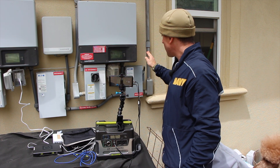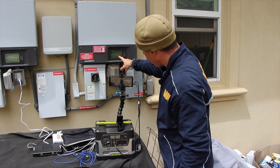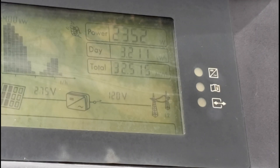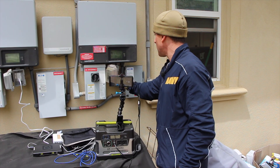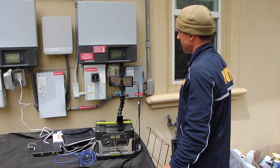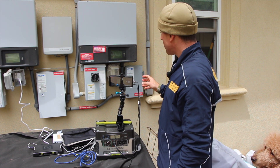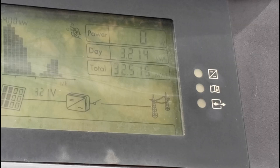So we come across here, the general duty safety switch — we turn that off. Now we're going to look at the screen and wait for that to start turning off. It's going to drop down to zero watts for power generated, and then we're going to turn on the SPS. We don't touch the DC disconnect. Now we wait, and it should show standalone operation. It does its self-test — AFCI self-test. Next thing should be standalone operation.